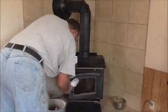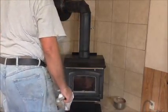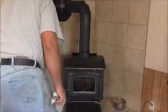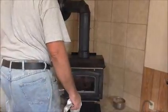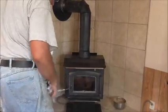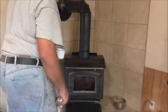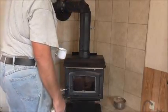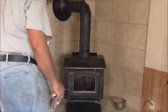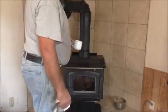And what I do, I don't go out and buy all that, we can't afford it, but for years now, when I do my stove, I do it the way the old timers did it. You don't want your stove to rust. You want it to last, and you want a rag, old shirt, cotton, something absorbent. You don't want polyester or some man-made material. You want something like cotton or flax or something that's natural. Burlap, I guess, would work, but it won't pick up the dust as well.